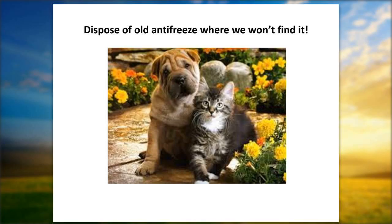As you use antifreeze, what I recommend and what we've done at our site is, after you've emptied 1 gallon of antifreeze, take your transfer pump and dump it into a used bucket that you have clearly marked, that will not make it back into the system. Then decant that antifreeze back into the bottle that you initially used when it was brand new, cap it, mark it used, and dispose of it properly.